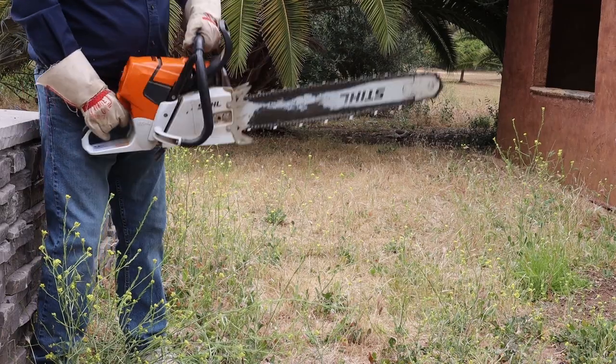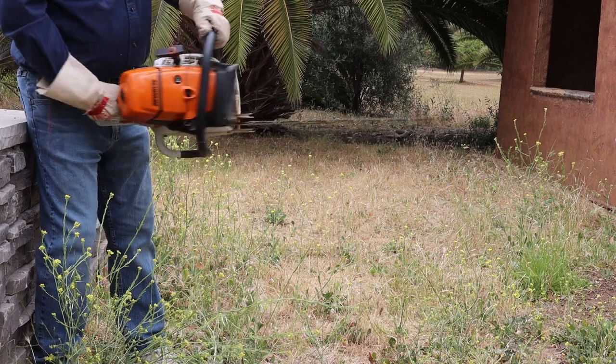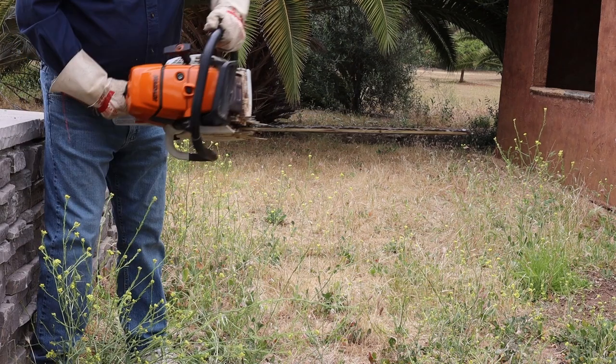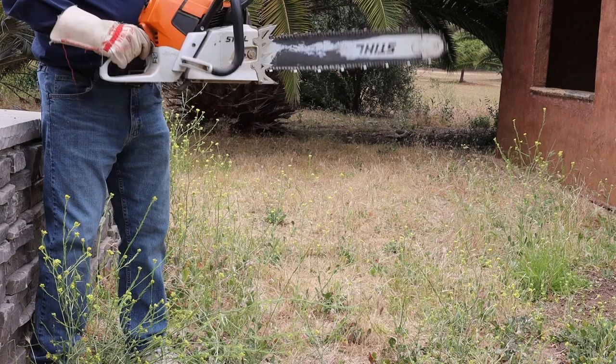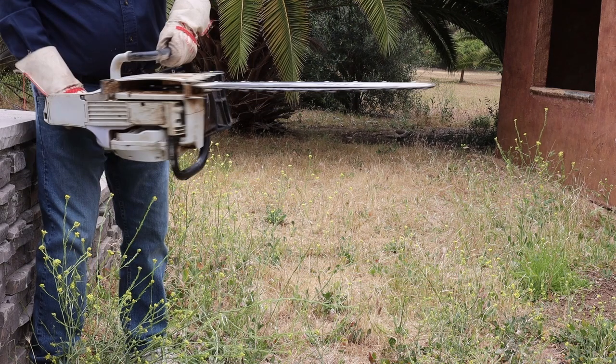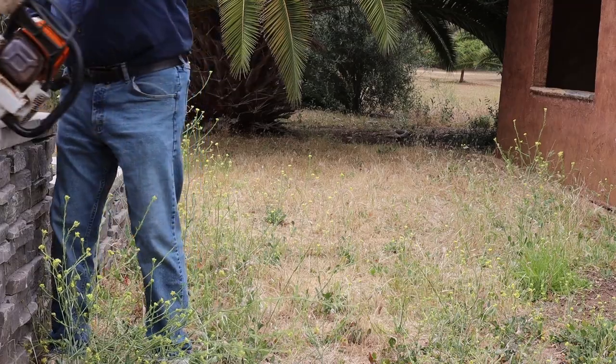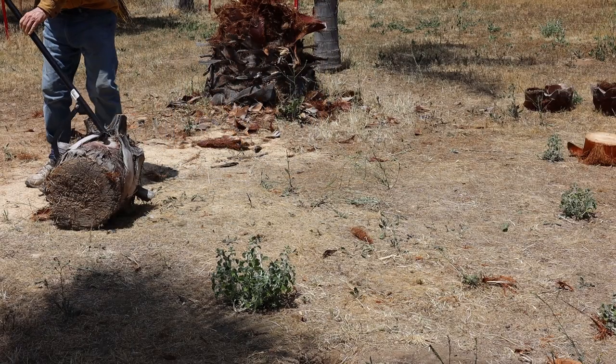The gravity-fed oil drops on the bar just fine when the bar is vertical, but in the horizontal position it may drop on the sprocket cover and not the bar — you may not want to run it like this for too long. In the angled position, the oil will drop on the bar and may get to the chain. There's the problem of the bar oil pick-off — it can't be on all four sides. Fill up the bar oil tank when using the chainsaw horizontally for extended periods.